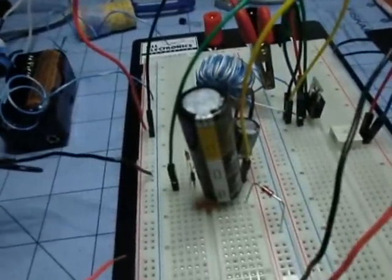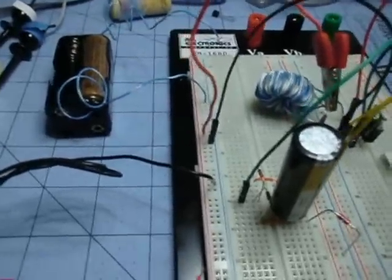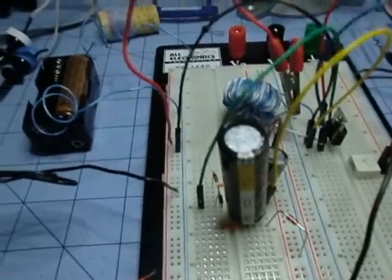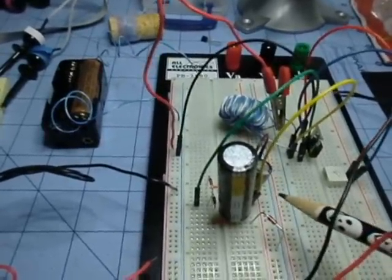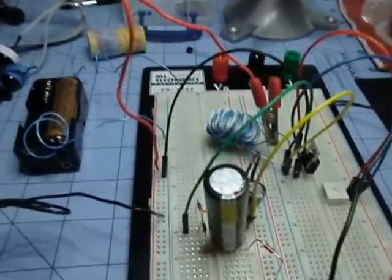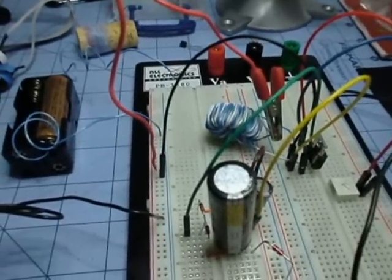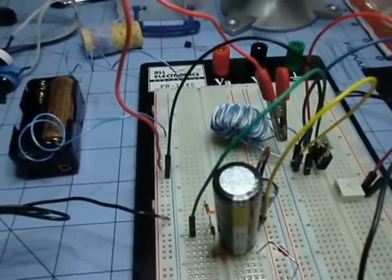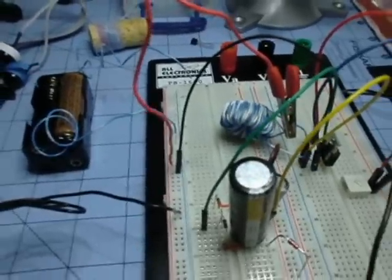I like this idea of the Darlington transistor that's all in one little package. I also, just for goofing around, upgraded one of the capacitors to a photo flash capacitor — that's this booger right here — 270 microfarad. And I put a Zener diode in to cap the voltage on that, but other than that the circuit's pretty much the same — standard Joule Thief circuit.